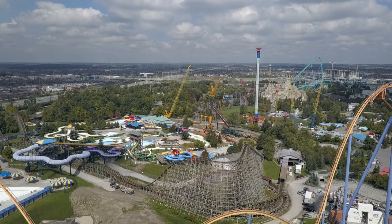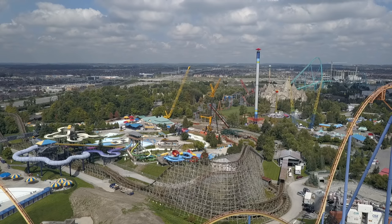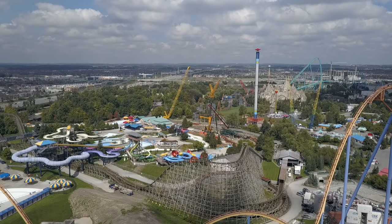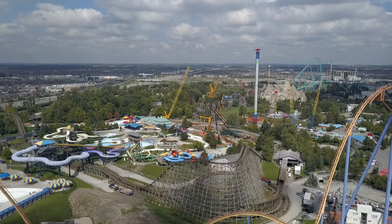You're definitely going to want to continue to watch the footage because you're going to see the lift hill piece lifted into place. Yeah, you can see again, this is a great shot of the chain falls and the angle that it's being held at and how they assemble it. It's going to be tilted a little better now. That's actually what they're working on. You can see it slowly if you look really closely. It's being angled to the 47 degree angle, but the chain falls hold it at that exact angle that it needs to be to installed.